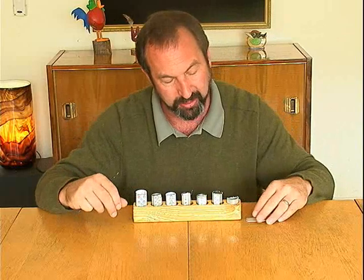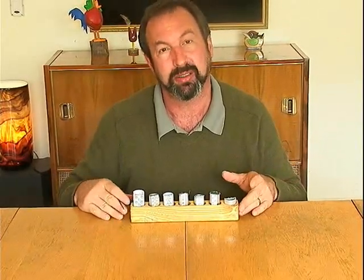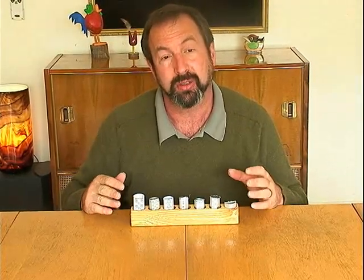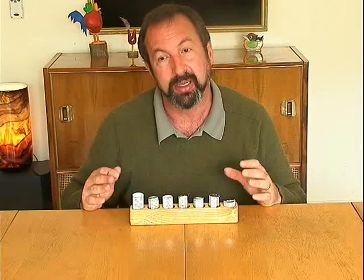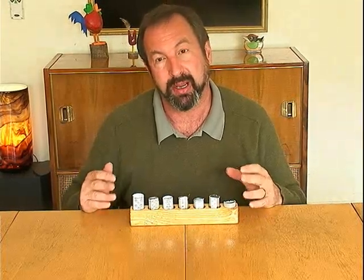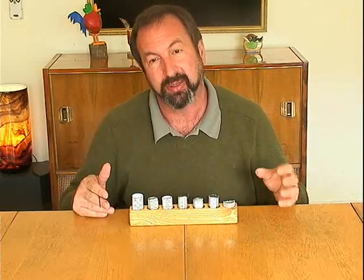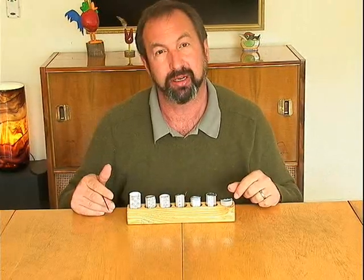So that's my short discussion of different design choices for LED tube lights. I'm bringing this out because the main thing that relates to the longevity of an LED light is the quality of its thermal management. If you want to say you have a 50,000 hour light bulb and that it's going to output relatively the same amount of light at 50,000 hours as it did when it was brand new, you have to control the heat buildup, which the design choices are all about.